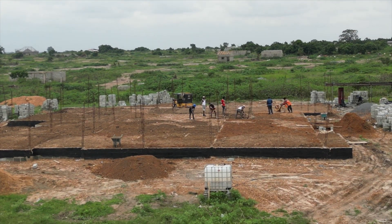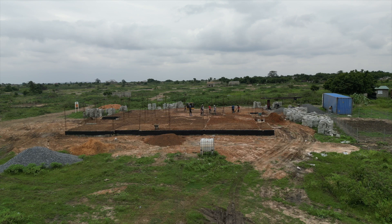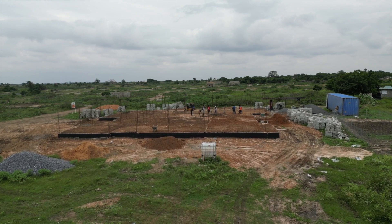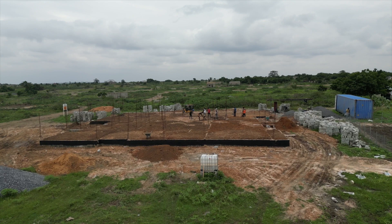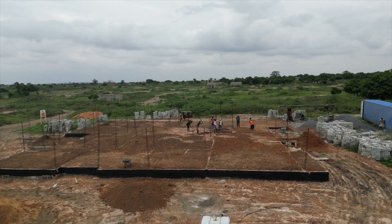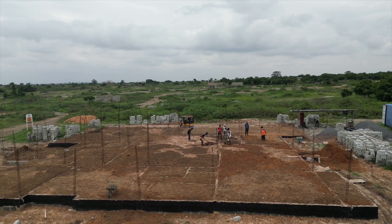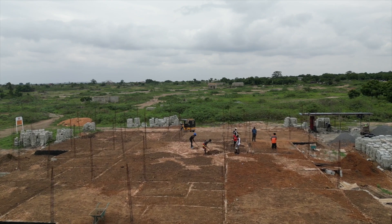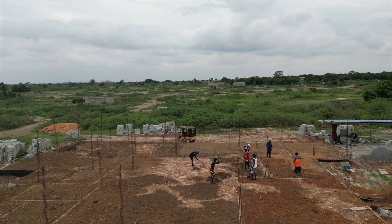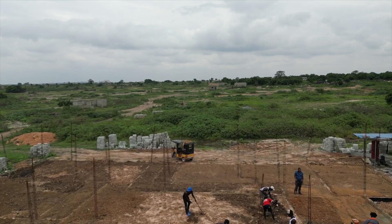The process of compacting is fairly simple. After the filling has settled — and I was blessed in my situation because there was a lot of rain during the time we did the filling, so the soil was able to settle on its own without me having to water it every day. After it has settled, you basically wait for the soil to dry out. The sun comes out, dries it out, everything seems nice and solid, you can walk on it and you don't feel any sinking. Once that is done, we bring the guys in with the compactor.